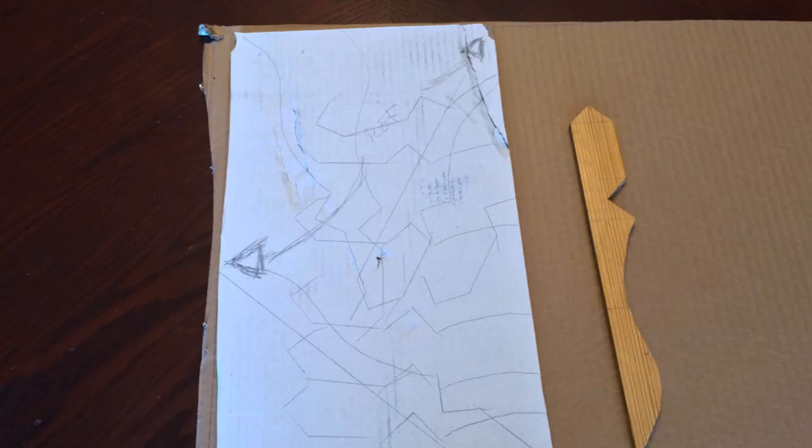Now it's time to make the template. I'll take a bigger piece of cardboard and reverse this process. I made reference lines with my framing square on this bigger piece to represent the edges of the shelf blank, and put the cardboard with my readings on top of it, with the two reference points touching the lines I drew with the framing square.